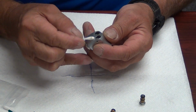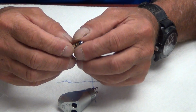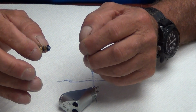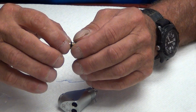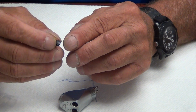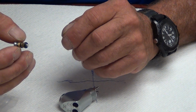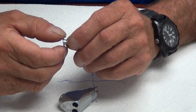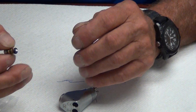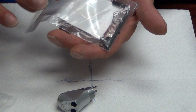Now we're ready to replace the cartridges. Ladies and gentlemen, the cartridges can be rebuilt using O-rings. You're going to add about 15 to 20 minutes after you're familiar with the procedure. At the start, you're going to add about 30 minutes onto it when you press these new O-rings on. So you can buy the entire button, which is part number 3625 from DCI, and replace the entire button. That is the easiest way to do it. They come in a repair kit. They have an Allen wrench, a spring, the whole 9 yards.